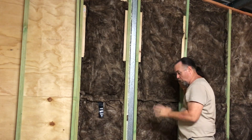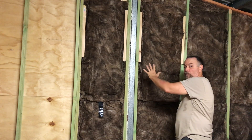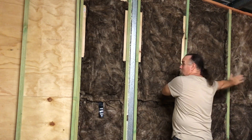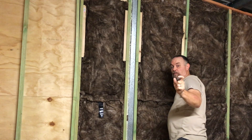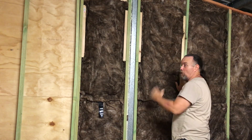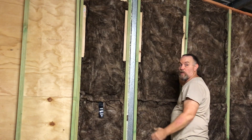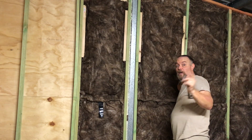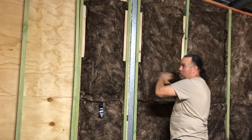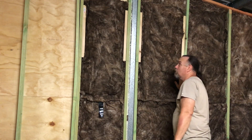All the wiring is already pulled out through the wall. I've got to get these two panels up and then put on the first skin. I'm laying it out with a 1200mm centerpiece, then 1200mm wide on each side with a little bit left over on each end — it nearly fits perfectly. The round angle will cover it all up later, but for the center I wanted to make it a feature, so a strip of nice timber will go down each side of the joins. It'll be either the purple color from the sound booth or the orange of the door, with blue on the outer — I haven't decided yet.